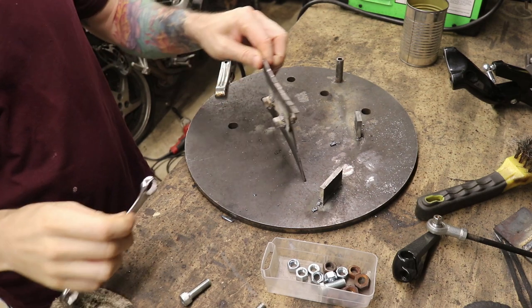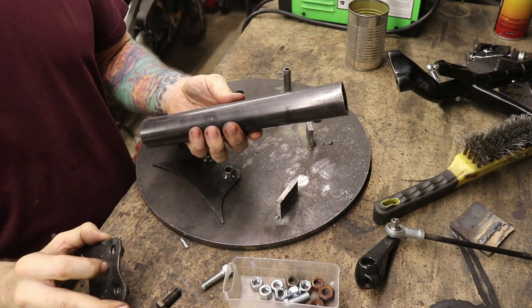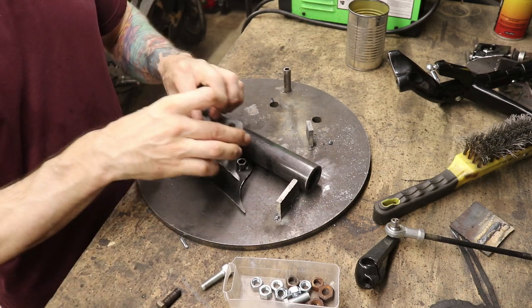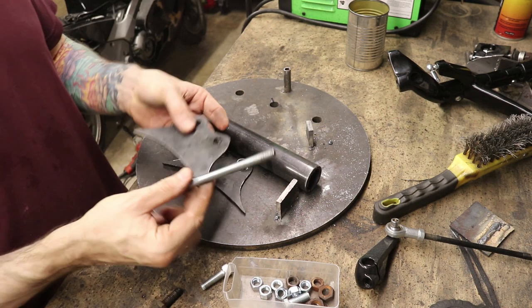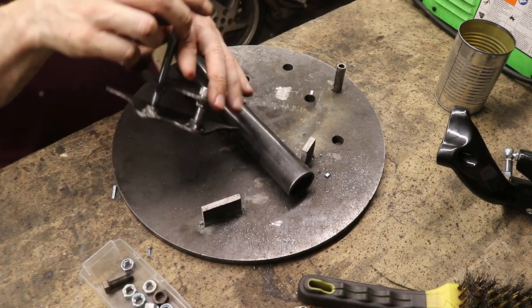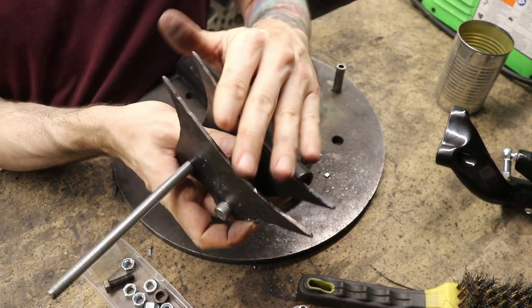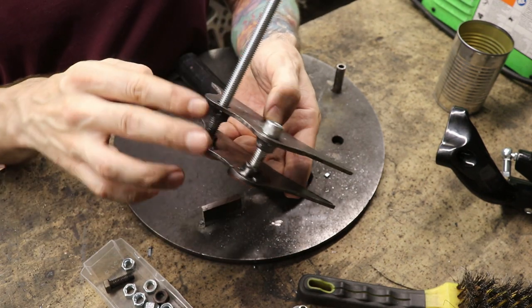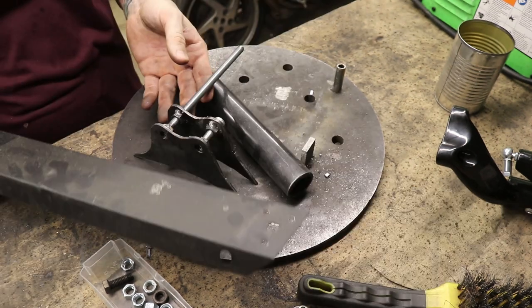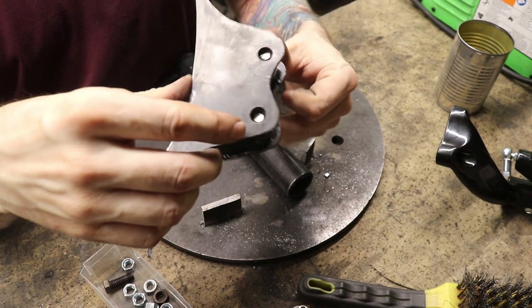Hopefully this hub has cooled down so I can take this apart. Now we've got our two halves with our nuts welded on them. I've also got this piece of tubing, the same diameter as what we're going to be welding this to. I kind of want this out on the outer edges of the tubing so it's flush. I've got a long piece of threaded rod to set the height. Now the side that's going to be open goes against the pipe — we'll weld this onto the actual frame. The other side we don't want open, so I'm going to cover that with this piece of scrap metal. It's got a coating so I've got to grind all that off, then weld it on and bend it around to shape it. A little extra dip there is going to be interesting, but I think we can get it done.